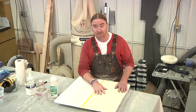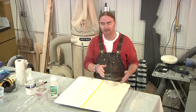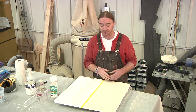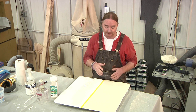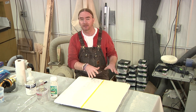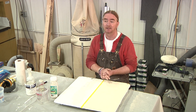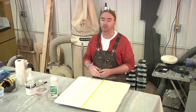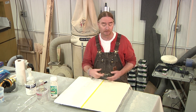We got all the excess soft sand cleaned up and I've got to say it looks really good — it's consistent, no thin patches or bald patches, pretty much consistent side to side and top to bottom. From here we need to seal this grit in place. Typically when working with paint I would go over the top with basically two seal coats of paint over two consecutive days. Gel coat is a little bit of a different creature, so what I'd like to do is go over with some thinned laminating gel coat, thinned with styrene to about 10%.